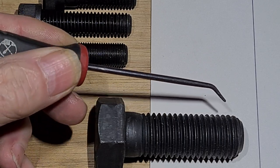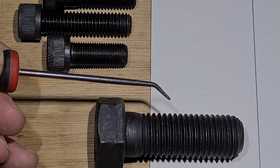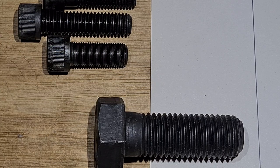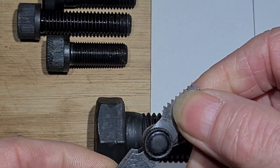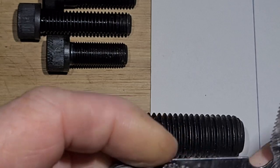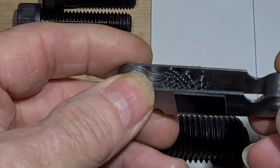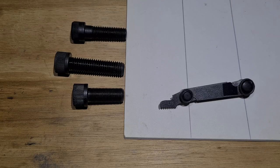When it comes to a finer thread on a tiny small bolt, counting becomes very difficult to do. So what you need are thread gauges - pitch gauges. I'm sure you can pick these up on the internet. They correspond to the actual pitch of each bolt - every bolt you can think of has a corresponding pitch gauge among all these different ones.